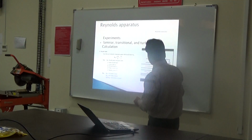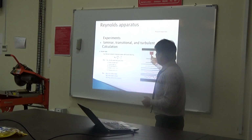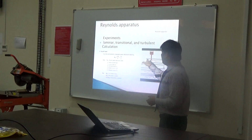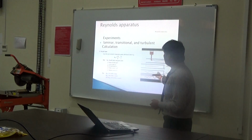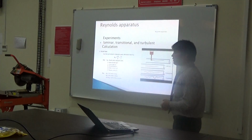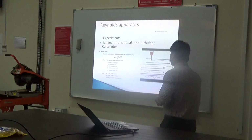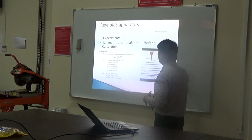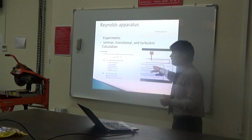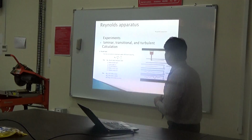Here we can understand the meaning of laminar and turbulent flow. Suppose it is a liquid pipe and I add another kind of liquid here, then this liquid will start to flow. If there is no disturbance in the flow of the liquid, we get a linear flow, and this kind of flow is called laminar flow. In case of turbulence, when the water molecules run very fast and create turbulence, the other liquid will not have a constant flow and will get disturbed. That time we call it turbulent flow. Linear means they flow step by step, and turbulent means they get disturbed in the straight line movement.